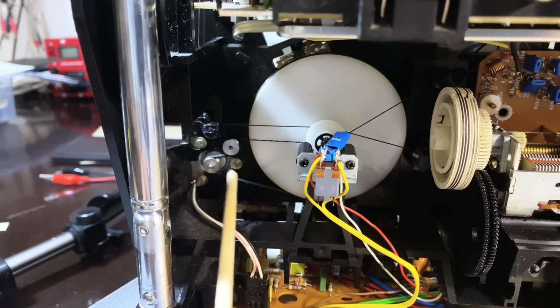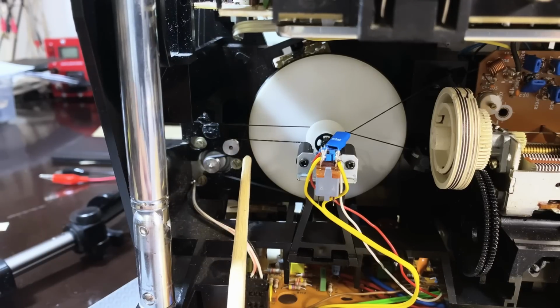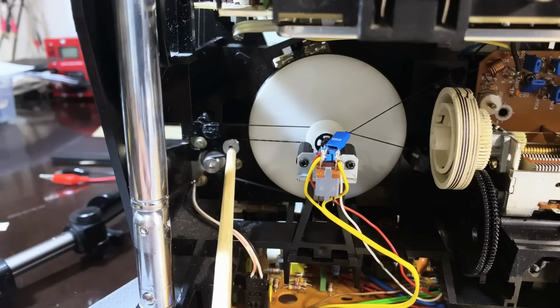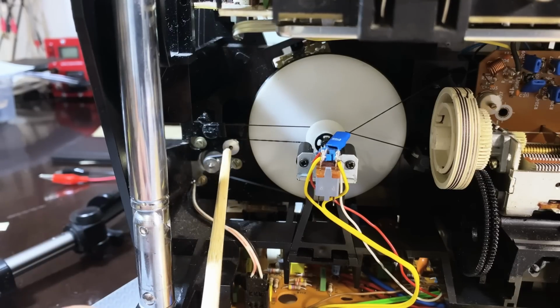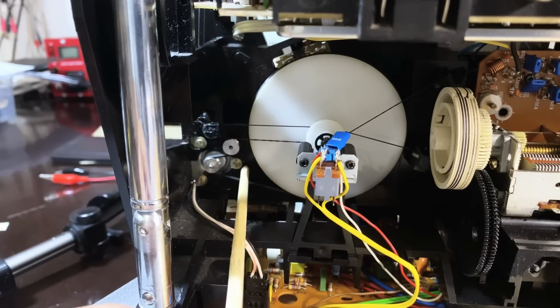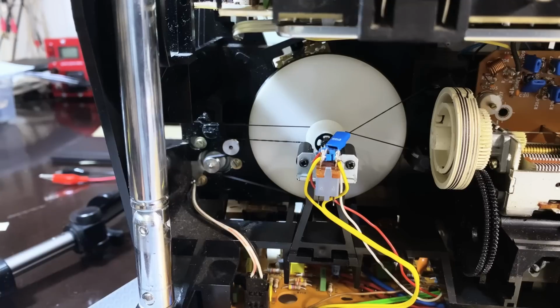The other thing I thought of is this pulley here is actually loose. This is the one that was the bottom of the radio when I got it. It actually comes out. And I was wondering, if you have a 3D printer or a lathe and you make a slightly bigger diameter pulley over here, that'll have the same effect as moving this out. It'll tighten the belt. So maybe that's something to look at as well, because, okay, this belt replacement was easy.